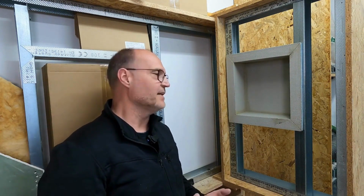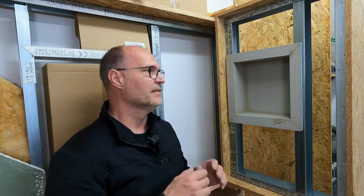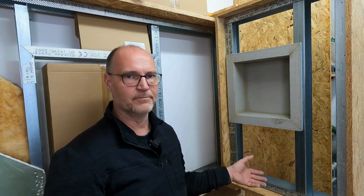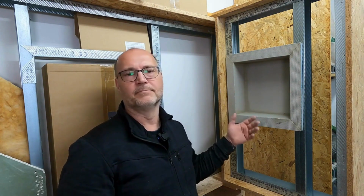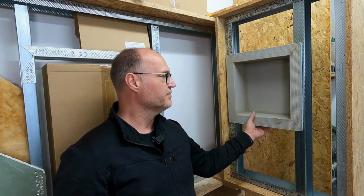However, this is usually not the case for me, as the walls are already finished. And when the tiler comes, I have to determine the height properly together with him. If it is going to be tiled, it could also be that I simply coat it differently, like plastering or filling. All of that is possible. The substrate is absolutely suitable for that.